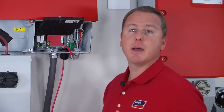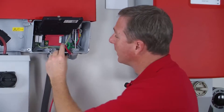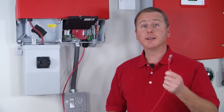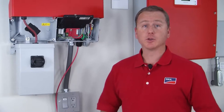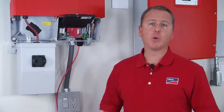The RJ45 slots are labeled A and B. It doesn't matter for a single inverter where you're plugging it in, so I'm just going to plug it into A. The other end of the ethernet cable will then connect directly to the customer's router. You can connect up to four inverters using the WebConnect module together and they will show up as one plant on the Sunny Portal.